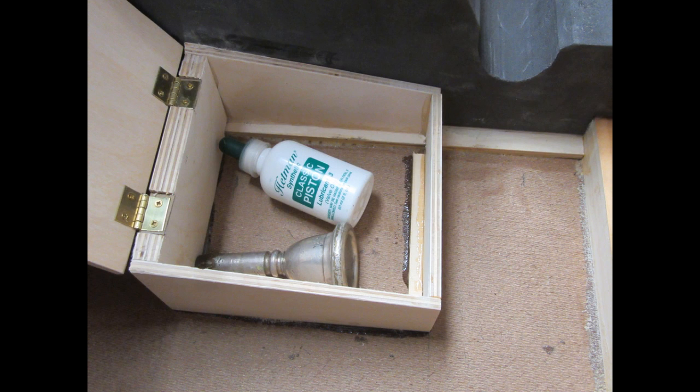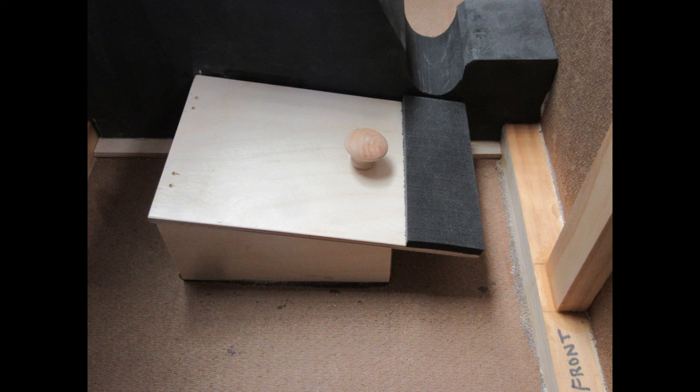Not shown is a step that I usually take to prevent damage to the case if any oils or lubricants leak. I usually apply a couple coats of polyurethane varnish to the inside surfaces of the storage box. The last step in the storage box fabrication is adding a pad of suitable size and thickness where the instrument will contact the box lid to hold it closed.